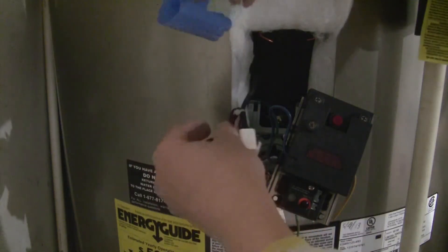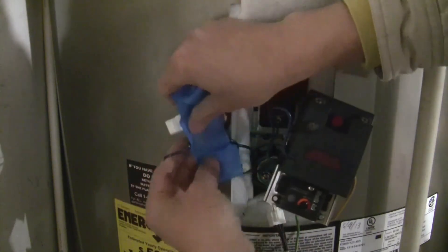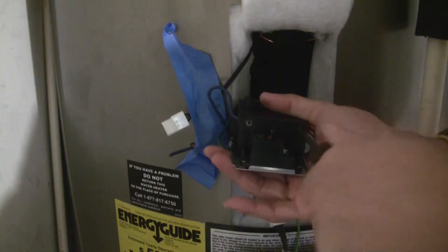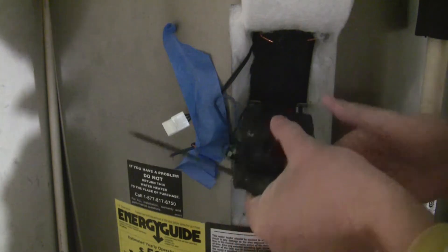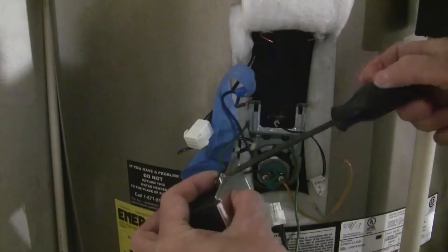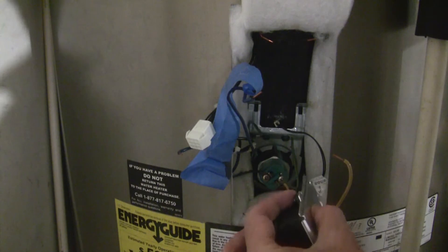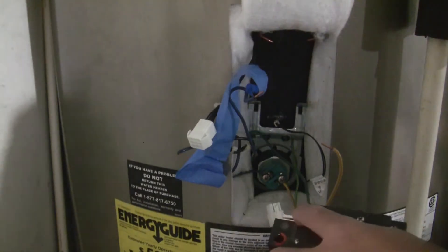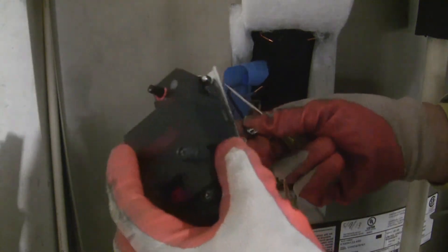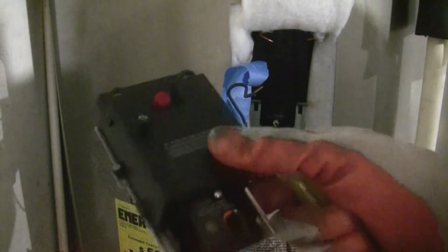Use tape to mark the two wires on the 2nd terminal on the left, so they will not be mixed up with the wire we are going to remove next. Loosen the two screws on the bottom of the thermostat and remove two more wires. There is a tiny screw on the thermostat holding the ground wire — it is so tiny, so be careful not to lose it. There is a clip on the thermostat holding the ground wire; I have to break it with a small flat head screwdriver in order to remove it from the old and put it in the new.